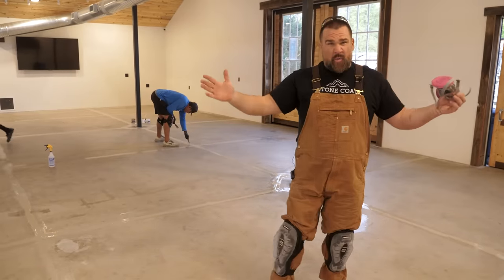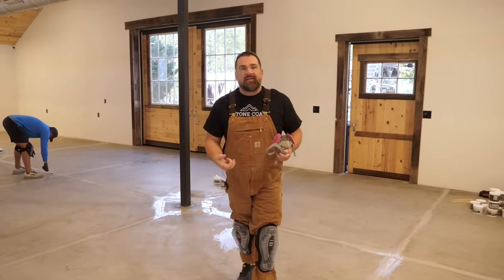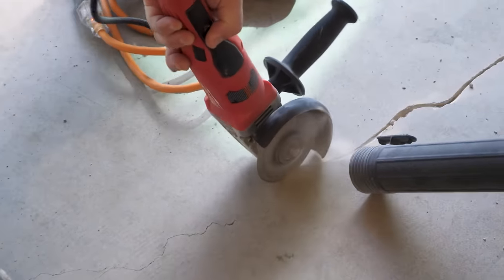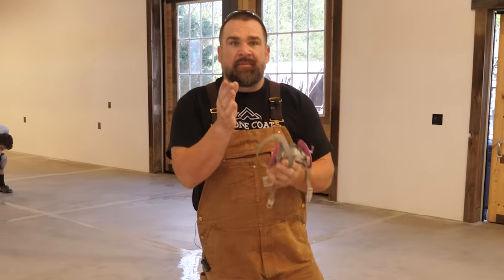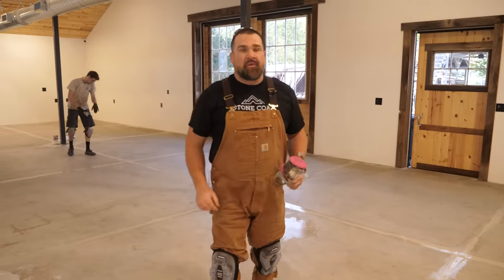That's why they put those expansion joints — you're trying to guide where you want those cracks to go, but every plan doesn't always go how you plan it. If it's a very thin, tiny crack, the crack patch will not get in there and fill it successfully, so we're going to open it up with a diamond blade that you can pick up at Home Depot. They also sell — I'll leave a link in the description on Amazon — what the pros use: it's called a crack chaser blade. You don't need it, but it makes this job really easy. It's almost like a cone-shaped diamond blade that's easy to follow the twists and turns of those little cracks.